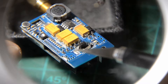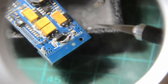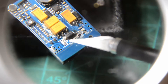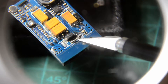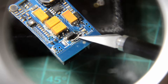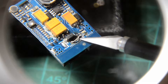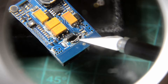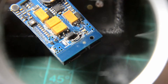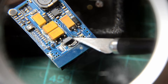The component here typically gets blown. I'm doing this under a magnifying glass. That little component sits right here and I believe that's a fuse that gets blown. Mine was still intact and in shape, but I lost the pad on the side of that little component so I could not solder it. I also lost the pad on the board because that fried and disappeared. So where you need to solder — if you don't have the pad — is to this little part right here which sits right next to the diode.